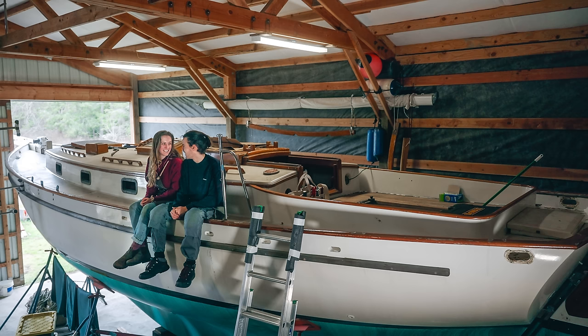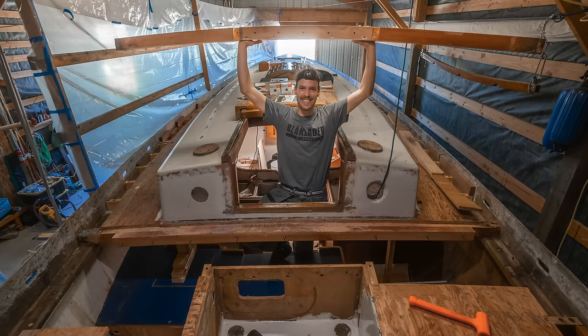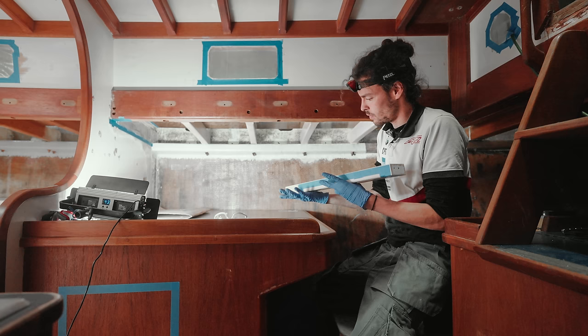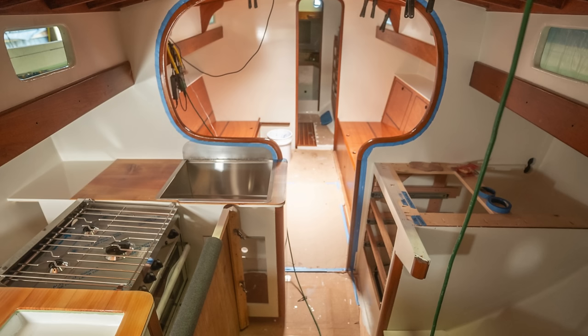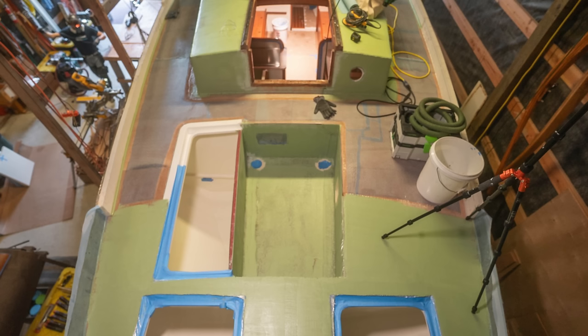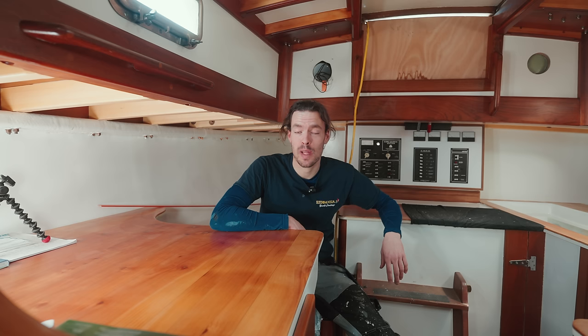We bought this boat sight unseen in the USA about 4 years ago. We knew it had some big structural problems. We had to replace the deck beams, open up the decks to do so, switch out all the blocks, and do some repair to the breast hook and the king plank. Basically it ended up being gutting the interior, rebuilding the interior, and rebuilding the entire cockpit from the hull. But now the structural work is behind us. We are starting to focus more on systems, and the goal is to splash this summer in 2024.